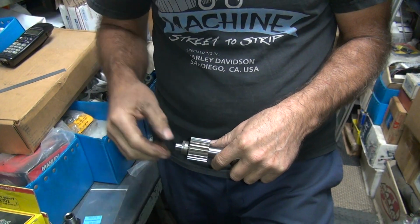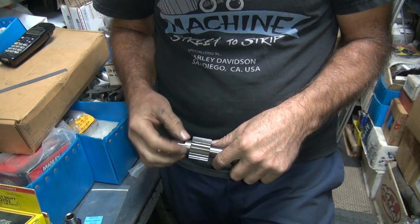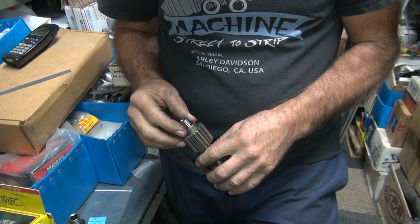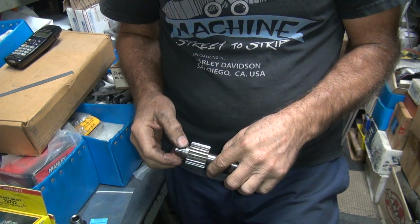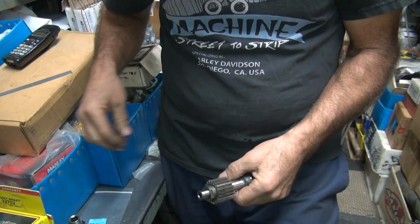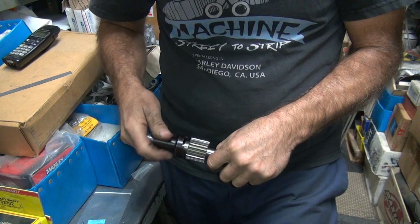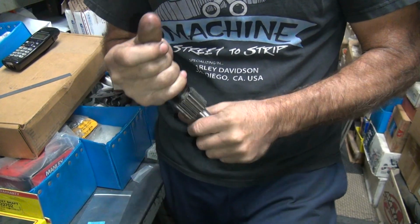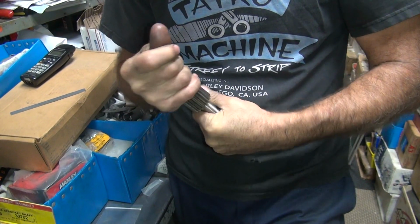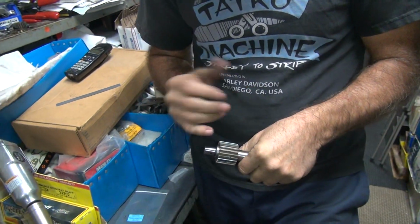We really need to go down about another 30 thou over there. Otherwise, we're going to do a lot of cutting. We need to get this nut below the surface. If we can't do it on the bushing, we're going to have to do it on this. And that means every gear that you do, you'll have to do the same thing.